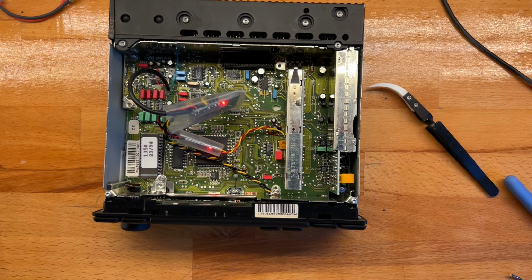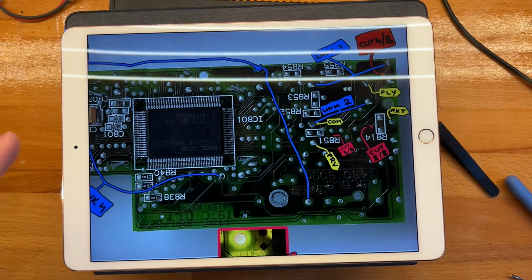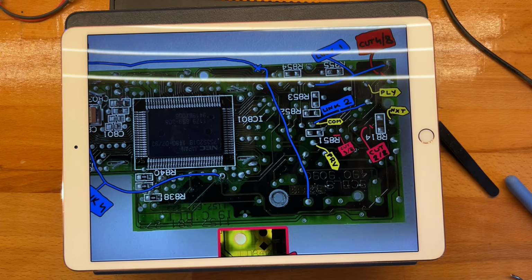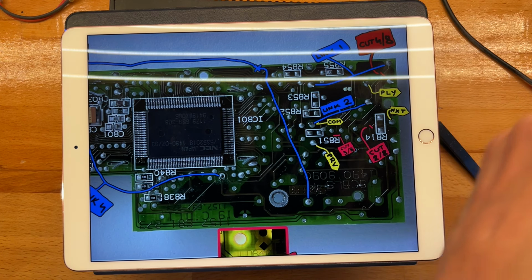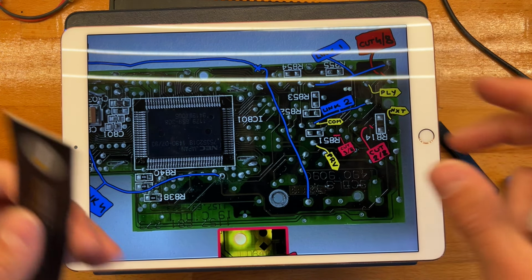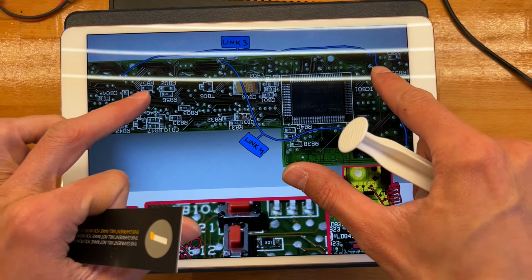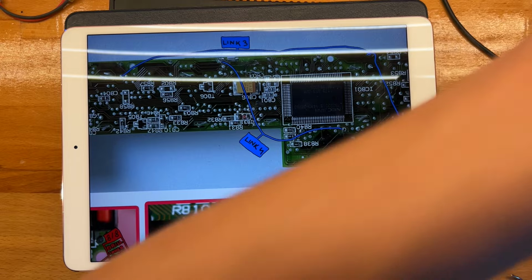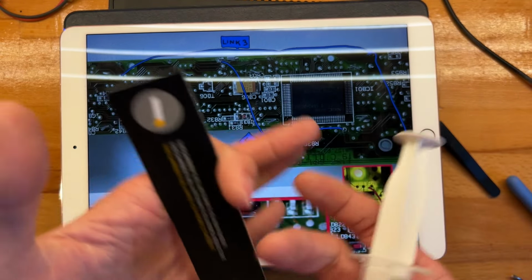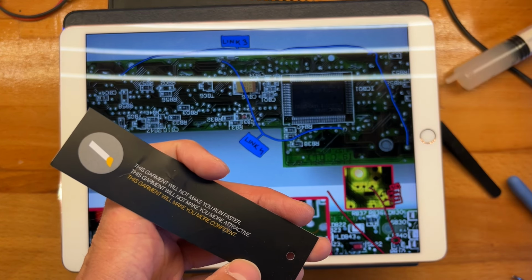I highly recommend cementing the, so you will have the tiny magnet wire floating around the board, right? And that is a huge problem because these will be vibrating their asses off, right? Even if you hold it inside your house, even moving it occasionally will make such a long thin wire link vibrate. And so what you want to do is get a little, I use a lot of it, so I have it in a small syringe, but you can use the big gun as well.